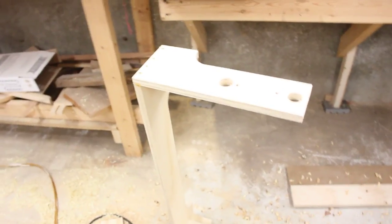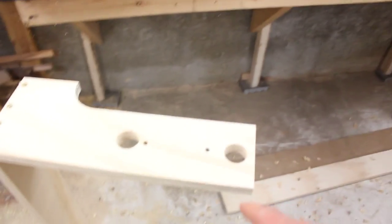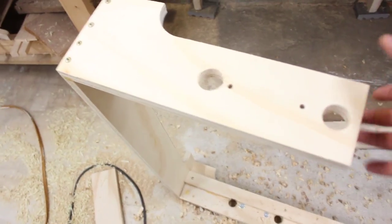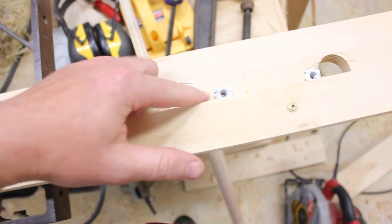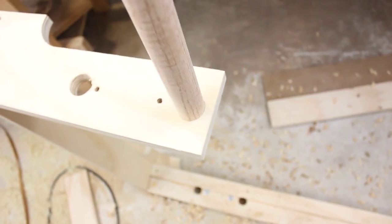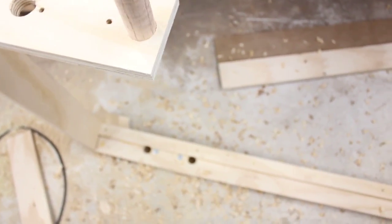It's another day. I ran out of battery power recording last night so I skipped some stuff. All I did was mount the rails to these guys — I clamped them in place, drilled all the holes, then inserted my T-nuts and used a C-clamp to press those in firmly. And now I am to the point where I need to take my dowel and fit it into the holes.